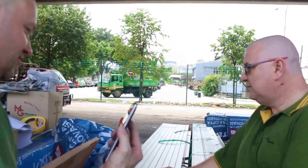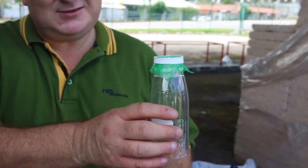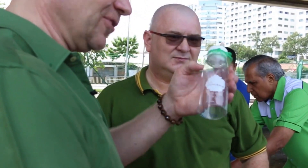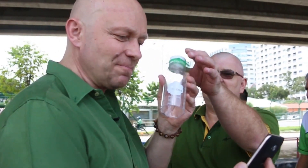Paul showed me something very interesting here. You made this here yesterday — what is this? This is actually the air diffuser, which sits in the floor. This allows the air to circulate from underneath and rise into the space. And then we have another natural air conditioning unit on the roof, which allows the air to escape — so this is the air circulation inlet. My friends who run Juiceria will be very happy that we are recycling their plastic bottles for our Greenman Tiny Home. That is the philosophy as well — we want to maximize the use of recycled and upcycled materials, turning a simple plastic bottle into an air inlet for the home.